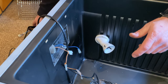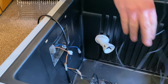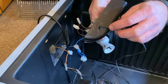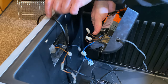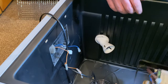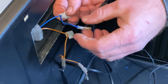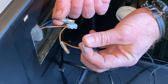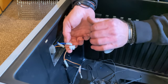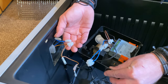We're now down at the business end - getting this wired up so we can put it all back together. I'll get the probe and put that in there out of the way. I've drilled a little hole in the side which should fit both of the light bulb black cables. This is where all the wiring was originally and it's going to stay in there. I've put connector blocks on here - that's the neutral, that's the live, and that's the switch live for the actual internal light which is staying. I've got connector blocks so I can tap into the main live and main neutral to hook up my cables.